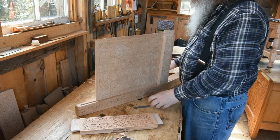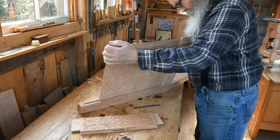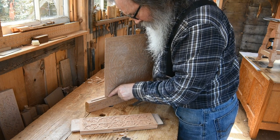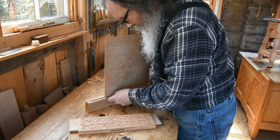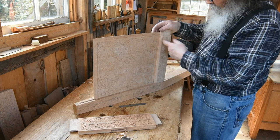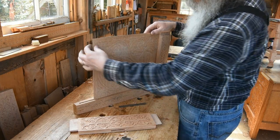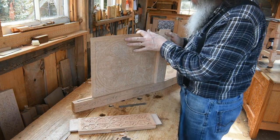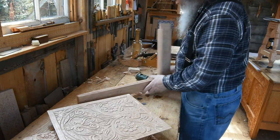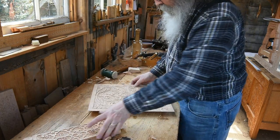At this stage the panel is very fragile, so any knocking about you have to be really careful. Right here I have a line that is the bottom of that rail, and the panel is five-eighths of an inch above that line. So I can knock this rail out and carefully remove the panel, then just trim a little off of each end grain — both ends — and try to thin those bevels out a little more so this will close up. The main thing at this stage is you don't want to bang those edges at all. That's why I want to get it in the frame and leave it there as I build the rest of the chair, just to protect those edges.